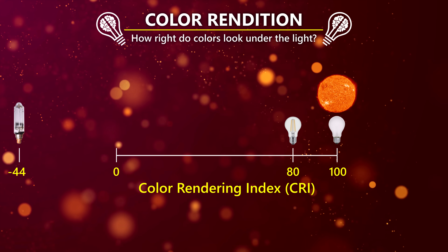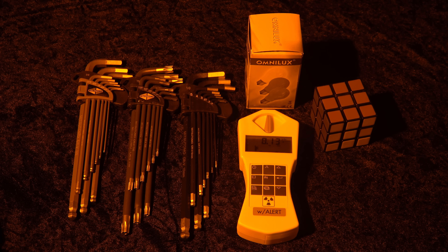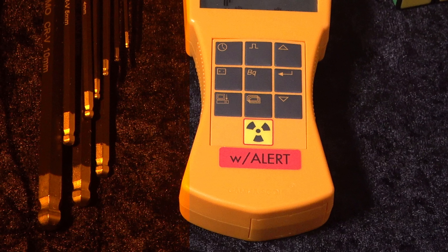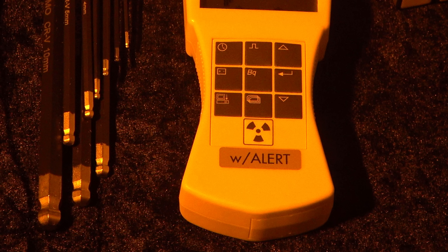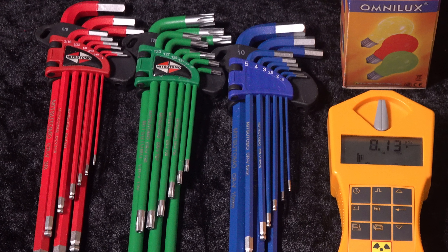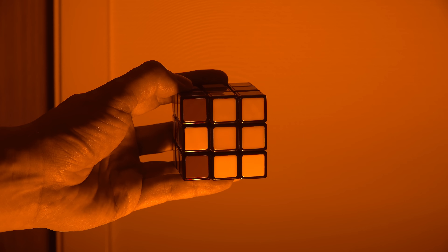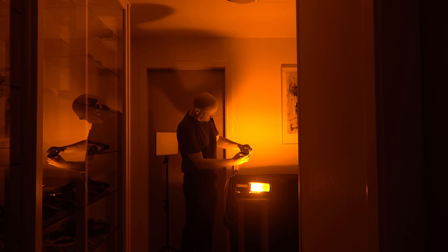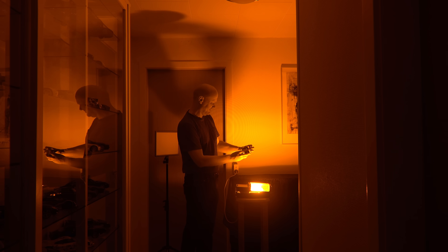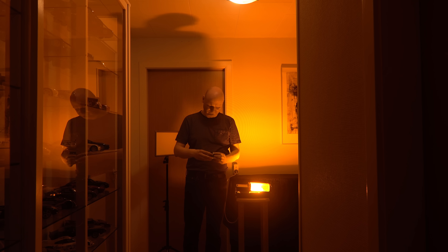Let's see what that does to our color vision. Here I have some random nicely colored objects on the high-CRI LED light — looks fine and normal. Now I will switch to the sodium lamp. I am not kidding. With all of the visible photons in the room being amber colored, everything is converted to a black-and-amber scale. Objects reflecting most of the 589 nm light, like truly yellow or orange objects, will look bright. On the other hand, objects absorbing most of the amber light, like the blue hex keys, appear dark. This messes with my vision and perception of illumination. After a while, I didn't perceive it as 1800 lumens bright — not until I turned on the ceiling lights and noticed they look way dimmer than I remember them to be. They were simply outpowered by the light from the sodium lamp.